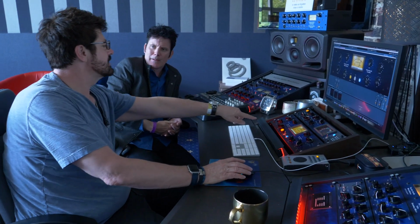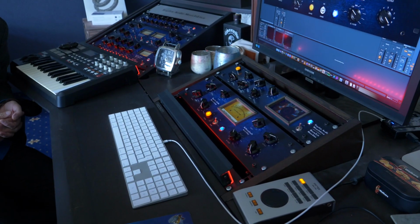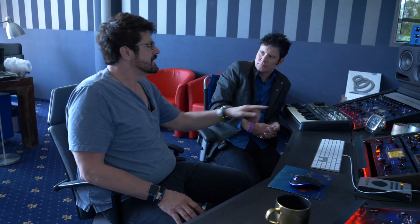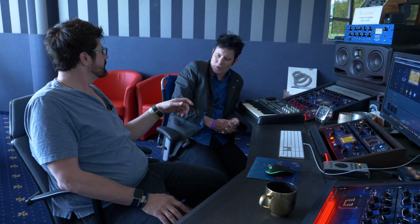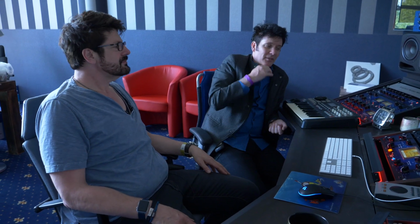Don't be worried that it takes some time to rotate. Even if you go from 0 to 10, it will go immediately, but just the pot will take some time to change. Right. Because the pot actually is not regulating that parameter, but it's done on the main board electronically. That's great. So the front panel is also some kind of remote control for the main board. I love that idea.